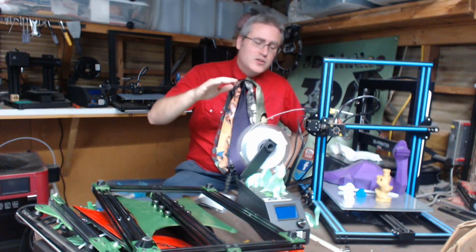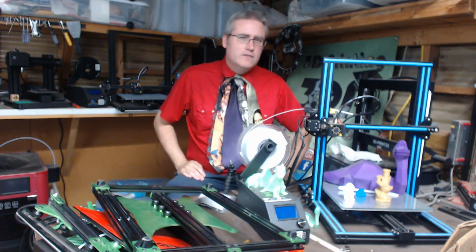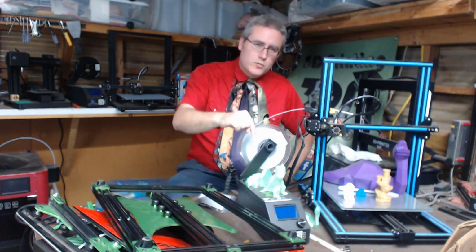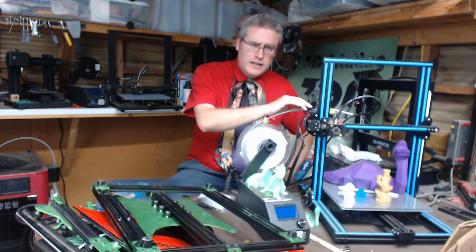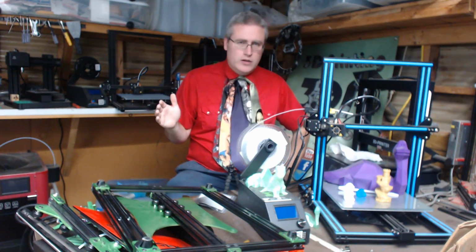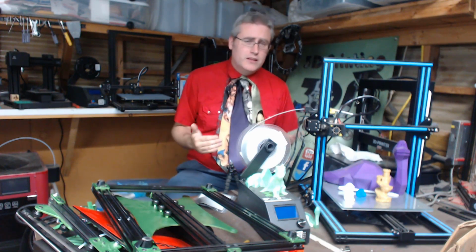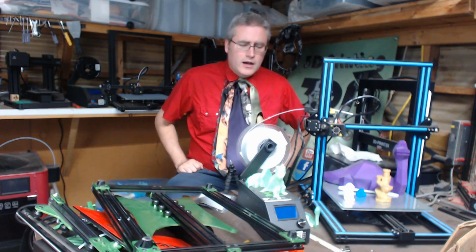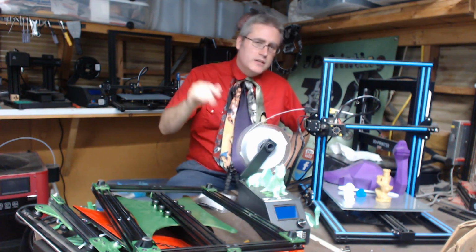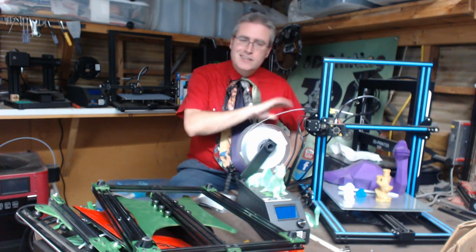So that is a feature that, while now a part of the Marlin firmware, is, I believe, by default turned off. And it's recommended that we update our firmware on our CR-10s and CR-10Ss to remove that feature, because it's going to ruin your SD card, and it's not worth being able to occasionally restore a print when the power goes out. Overall, though, the CR-10S has the capability of doing that upgrade easier than a regular CR-10, because a regular CR-10 doesn't have the bootloader.